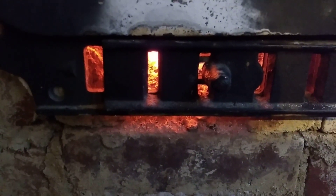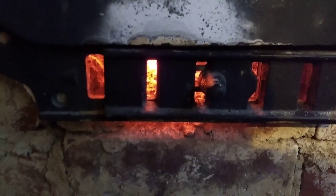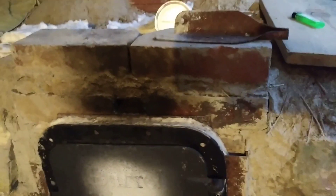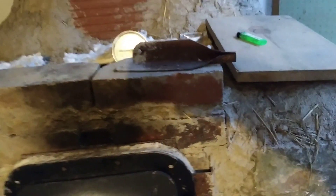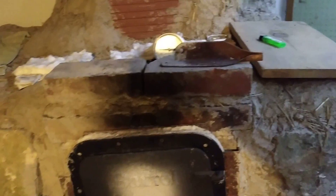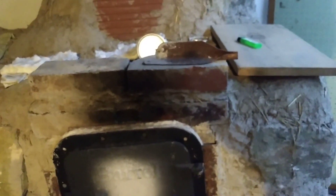Go back here — you might be able to still hear the rumble. I just love that sound. Here's my secondary air, or tertiary air, for the P-channel. There's my tertiary air P-channel inlet. I don't have a base channel because this was still designed for the original batch box. The roof is brick all the way to the back. The ceramic fiber blanket is inside of an 8-inch stove pipe, which makes it a 6-inch riser — 1 inch of ceramic fiber blanket, reducing down to a 6-inch heat riser. So it's a 6-inch system.